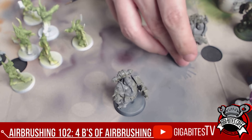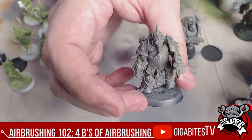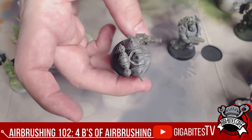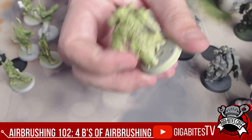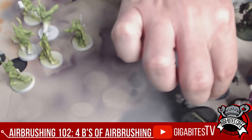Thomas, that's probably your compressor. What kind of compressor do you have? You need a compressor — an eighth horsepower is what I've got, and then a good regulator. It shouldn't have a problem staying too low. Mine is at eight right now, staying pretty good. The regulator is what keeps the air at the same amount. The tank is not going to do wonders for you, but you might be able to replace the regulator.